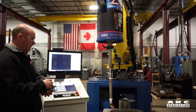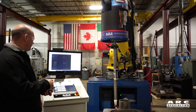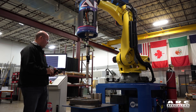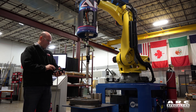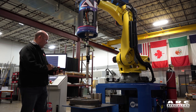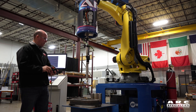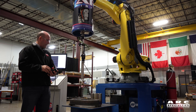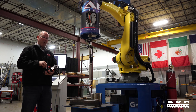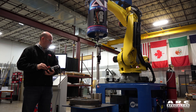I can stop and go back out to a larger radius. Let me show you a few of the motions that are possible with this machine. We can put the modes in several different selections — one of them is the X and Y direction. With this joystick I can control the robot motion and torch motion in the X and Y axis, moving it linearly closer and away from me, as well as in the Y direction to my right or left.